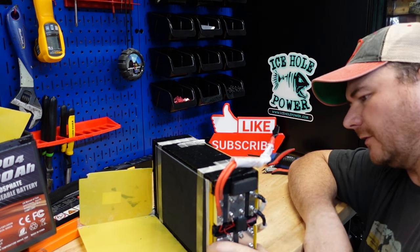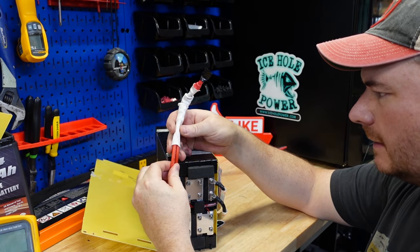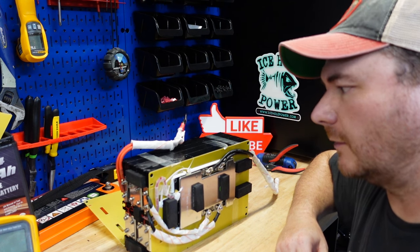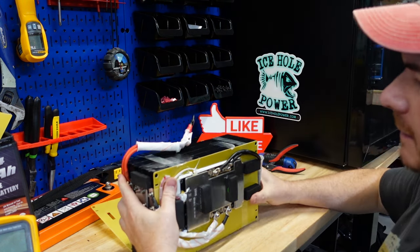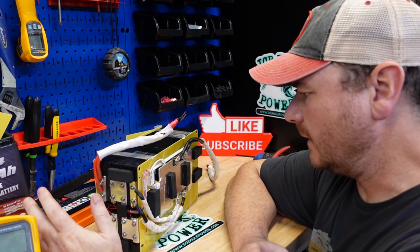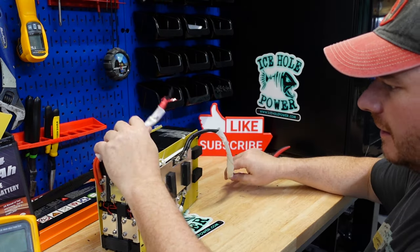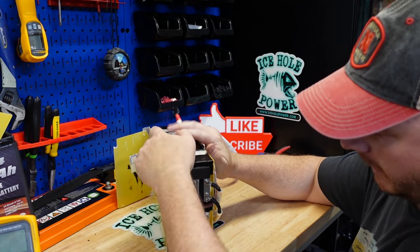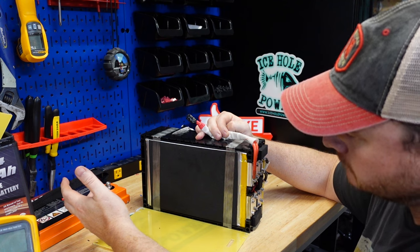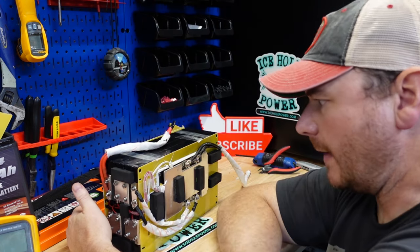Here's where they're hooked up in series. Very interesting — there are little channels through the pouch housing for the wires. These are 8 AWG wires, doubled up on both the negative and positive leads. The BMS looks to be pretty good — I'm basing that off the short circuit protection cutoff. The part number looks like B01-04-344. Every wire has some sort of protection on it and the balance leads have wire wrap with their own channel through the pouch housing.